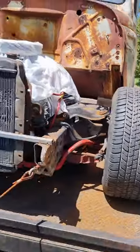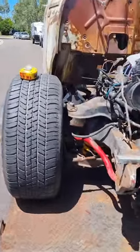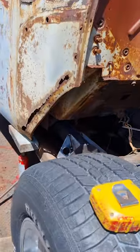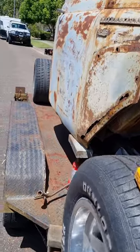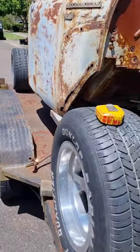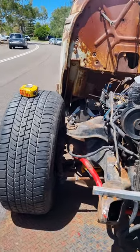So I'll take the driver's side out, cut it to length, bring it back up, put a block of timber on it to make a mount. Then I'll take the other side out and do the same, have them sitting in the right place. Then when I've got it sitting on the timber, I can actually slide the cab around more freely to really get it squared away, so that I can actually start making the cross member.